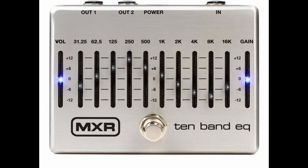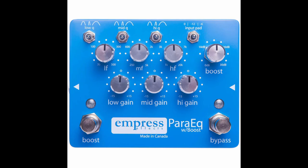That aside, let's talk about some EQ basics. EQs can come in a few different flavors, including graphic and parametric. Graphic EQs are a bit easier to interpret at a glance and quicker to set up. On the downside, they're less customizable. You're only able to adjust the frequency bands provided by each slider. Parametric EQs give you the ability to select specific frequencies and change the Q for each band. You'll have fewer frequencies that you can adjust at one time, but the control you have over each center frequency and Q will be far greater. Just like the name implies, the ParaEq MKII is a parametric EQ.